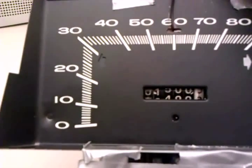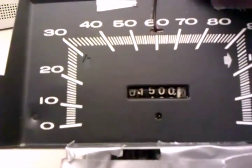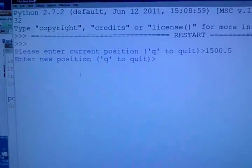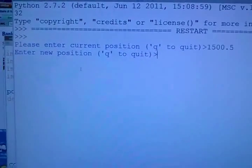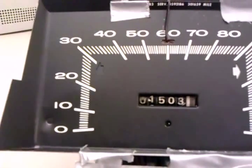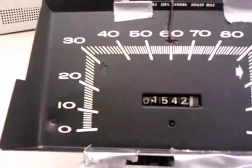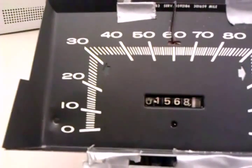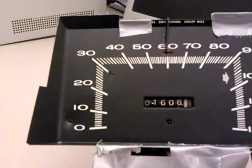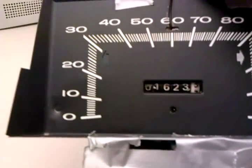Because I gave it an integer number, it's right on the edge of 1500 and 1499. It's actually good to give it fractional values and put it somewhere around .5 in order for it to understand where to go. Let's go to 1623.7. You'll see it starts rotating up — it starts off kind of slow but then speeds up pretty quickly. That's to give the gears a little bit of time to adjust to the changing speed, because as much as we try and reduce friction, there still is a friction problem. And there it is: 1623.7.